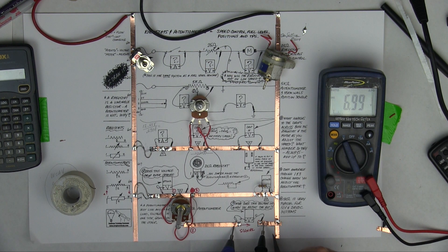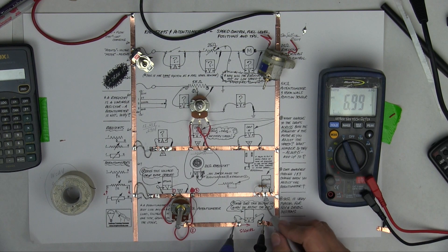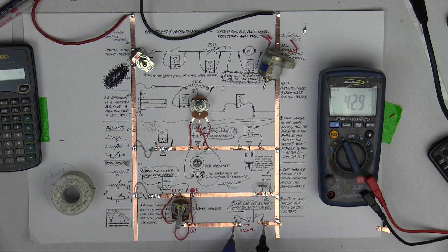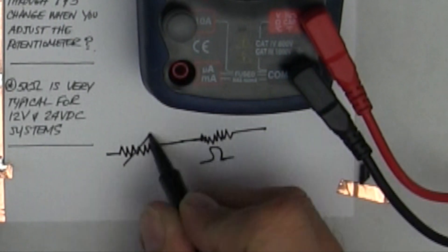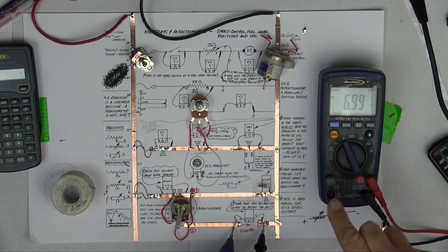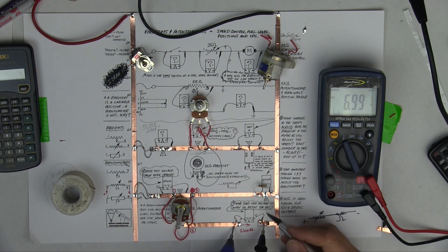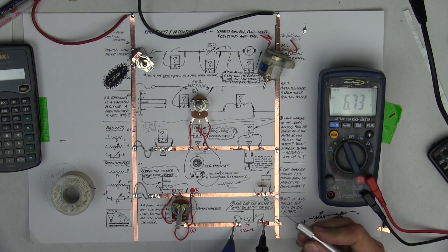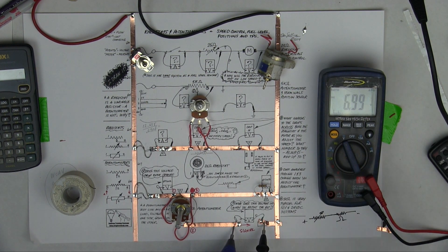It got bigger - I was wrong in my prediction. You guys play around with it and figure out why. Draw it out - we've got the rheostat, then the corrosion resistance, then the variable resistance. If I fix it, notice that my position sensor reading goes back. It's a difference of half a volt - the position is right but the signal is wrong, so the computer thinks the boom or arm is somewhere else.